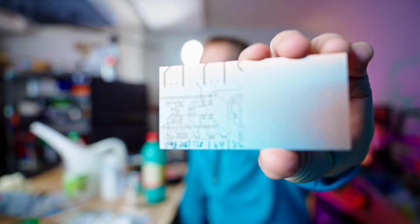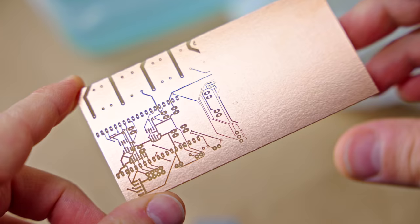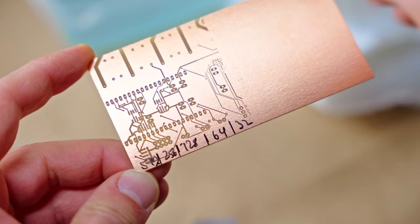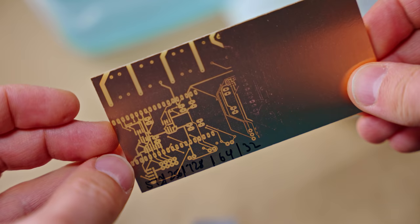You can see all the structures are nicely there, there's almost no sign of pixels from the printer's LCD, and about 64 seconds — so about 1 minute — seems to be the right amount of exposure for the Elegoo Mars 2 Pro. 32 seconds seemed to have a bit of trouble getting all the photoresist off and properly exposing, but if you go beyond that you're getting overexposed and removing more photoresist than you have to. So 64 seconds seems to be pretty good.